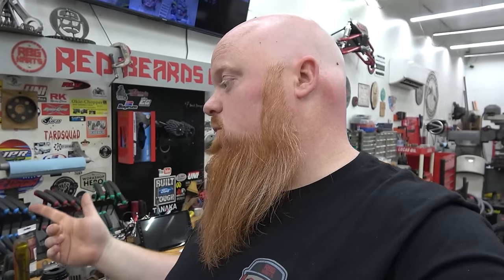We're also going to move the rear shocks. The buggy's way too stiff. Front and rear, it literally bounces you all over the place. So that's what we're going to do in the next episode, is replace the front shocks, move the rear shocks forward, and we finally ordered a harness for that thing, because you about bounce out of the seat. So we need to make it safe, and then we'll do another ride after we do the suspension upgrade.